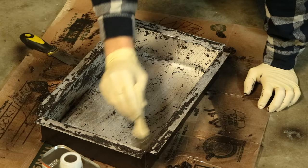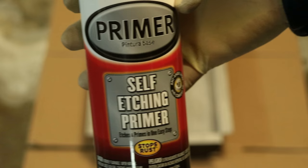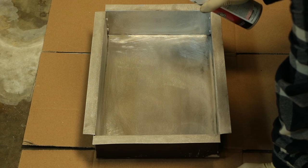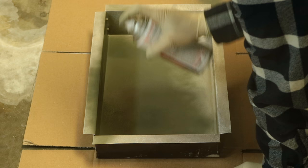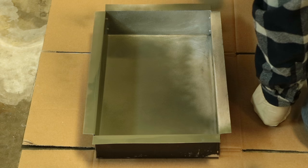I'm using what's called a self-etching primer. There are a bunch of different chemicals in this self-etching primer, and it actually adheres itself to the aluminum. By putting a primer layer on there, you're basically just painting over the primer — you're not actually painting onto the aluminum, you're painting the primer. So after you get that primer on there, I put about four coats on myself. If you want to do more or less, probably two coats would be sufficient enough. I put four coats of primer on here, then let it dry for an hour because you're supposed to let it cure. After that, I put on my paint. You can put on whatever kind of paint you want. I happened to use what's called OD green — if you're familiar with old school camouflage, everything old school used to be OD green, also known as army green. I had some cans left over, so I decided to use that. I think the OD green looks a lot better than that gloss enamel black paint I was using.